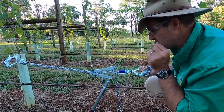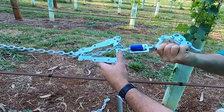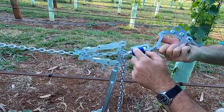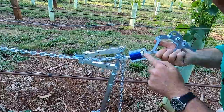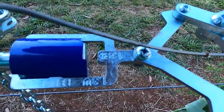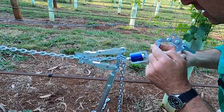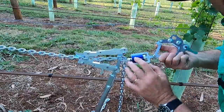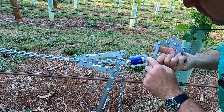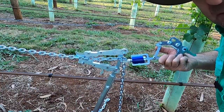That's an absolute boon for OHS. In this day and age where you can get sued by your employee if they get sunburned, no one wants their employee's hands around chain or strained wire. With the spring-loaded tines, there is absolute confidence they're going to work every time, the chain's not going to get tangled, and there is no reason for anyone to have their hands in the way. If you employ people to strain wire, you've got to get a set of these. Now up the business end, there's yet another swivel — so we've got two swivels, meaning the chain can never twist on you. This swivel is attached to a tensiometer that will tell you what tension you're straining the wire to within a reasonable margin of error. If you've bothered to read your wire tag and want to strain to optimal tension, there's no need for extra gear — these strainers do it for you, with markings at 1.3, 1.8 and 2.2 kilonewtons for the most popular types of wire.